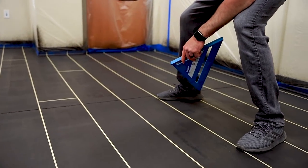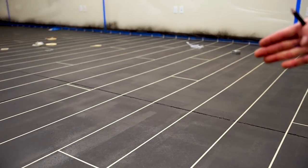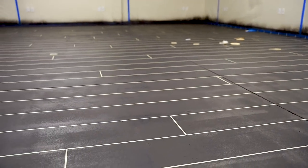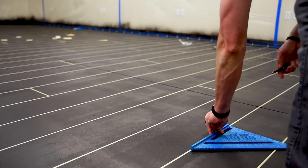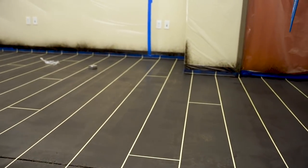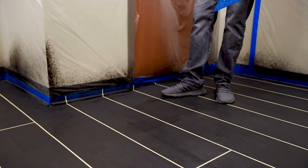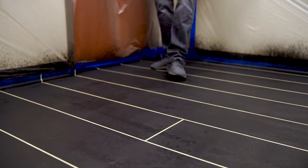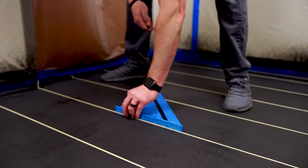And I'm kind of looking down the line, just making sure I don't line up with one a couple planks over, right? So I don't want to put one right here. I'll put it over just a little bit. Quickly look at that before I mark them. And then we got a plank right here, obviously, so this can be its own plank. And then we just start again. So now I can put one maybe right here because we don't have nothing here. Put a plank here.